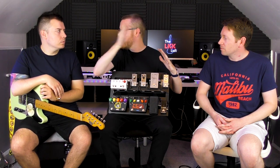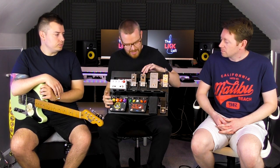I've taken the idea of a Tube Screamer and looked at what happens with the frequencies. So with a Tube Screamer, pre-gain, there's a lot of bass roll-off. So it's cutting bass, then it's gaining up, clipping the signal, and then if you took an output there, you'd get a really bright, in-your-face overdrive sound. So then it's having a pretty heavy high end roll off post. So what you're left with is a gained up mid range, and that's what gives you the mid humped Tube Screamer sound. So in this clean boost pedal, it's complete, it's clean, there's no drive in this.